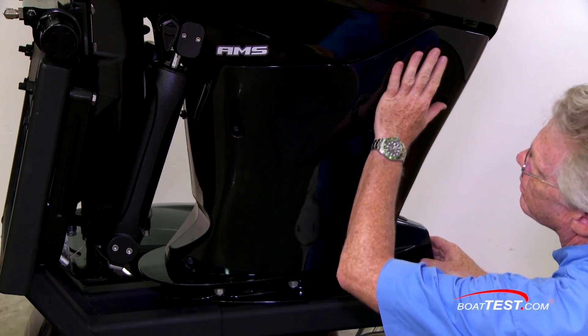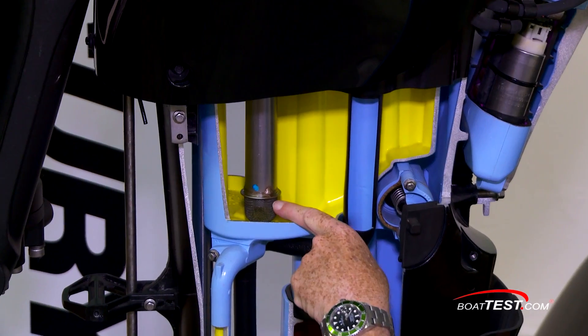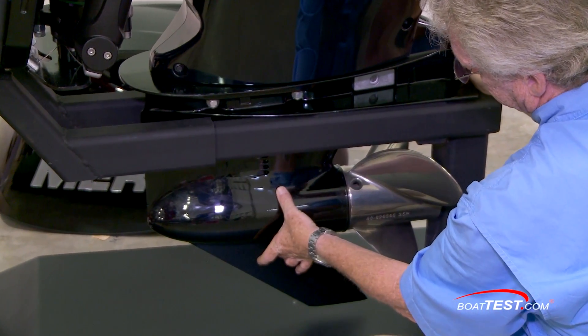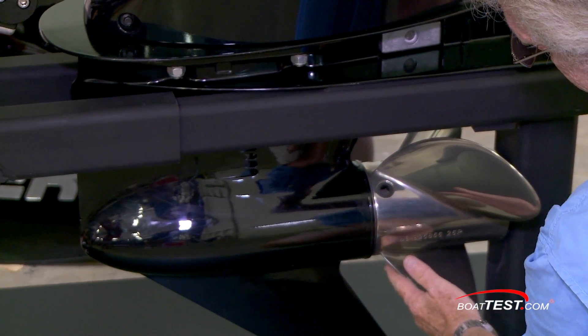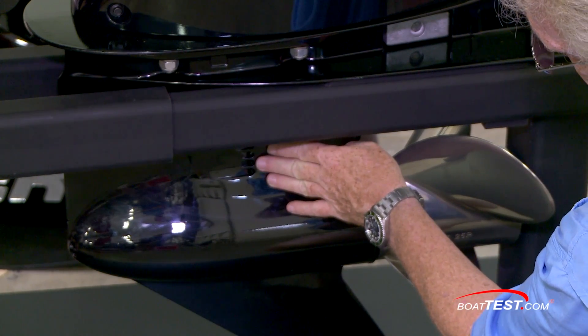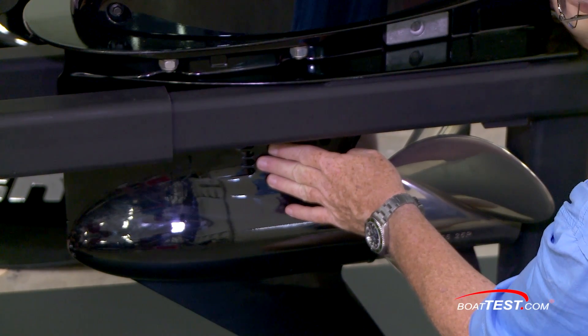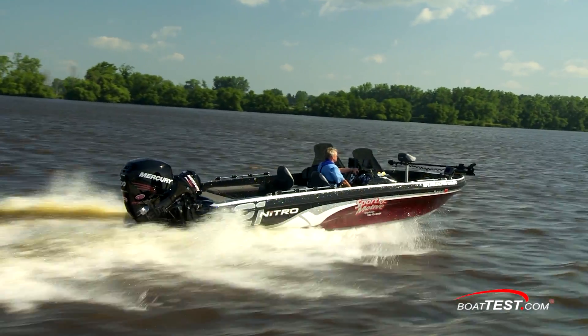The midsection houses the 8.2-quart oil sump that includes a pickup that works whenever the crank is turning. The gear case on the Pro 4-stroke version uses a 4.8-inch diameter bullet for better hydrodynamics and performance, utilizing both low-speed water intakes to the front and high-speed water intakes to the sides. This unit presents less drag so it can go faster, which is ideal for freshwater fishing and pontoon boats.